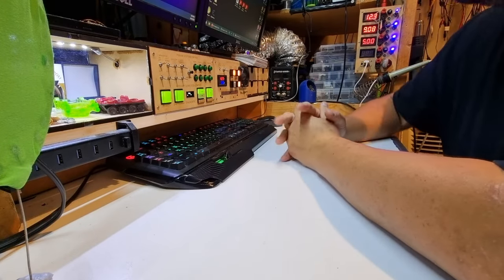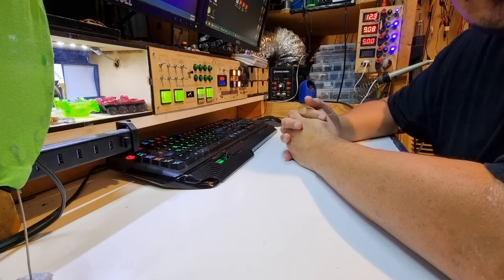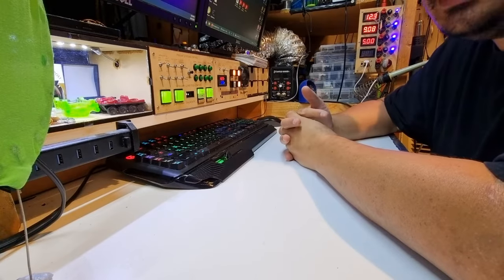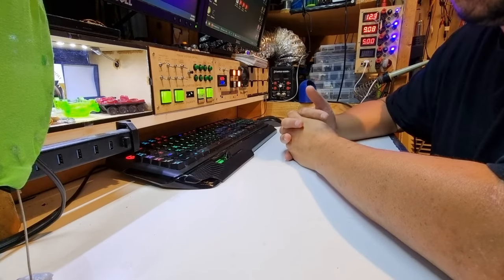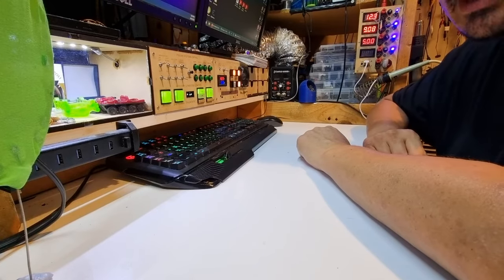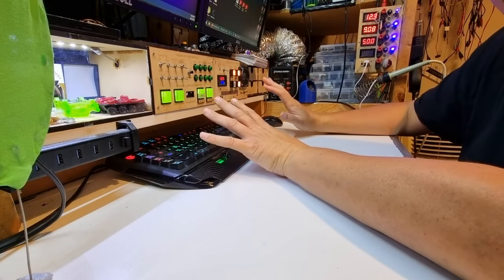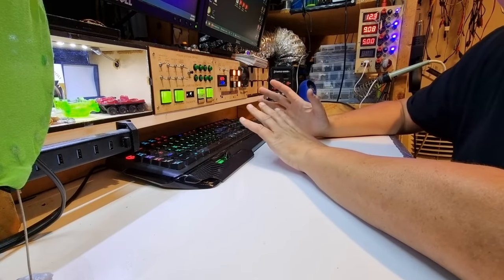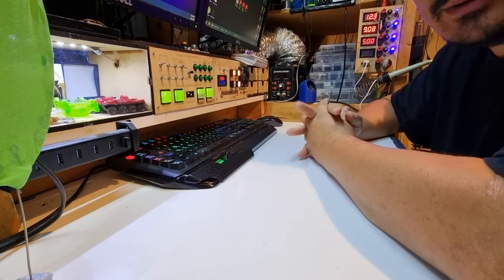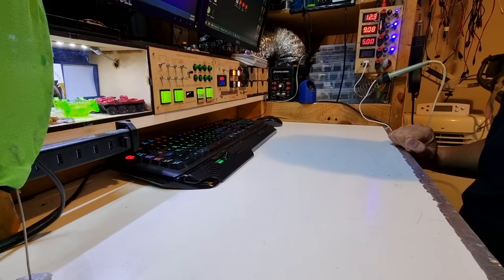Anyway, with this TV, I need to open it up and make a modification to the power switch so that a relay on the Raspberry Pi can trigger the TV to turn on. That being crucial to the one button setup I've got. They can use a wireless remote for some wireless power points, and they can turn on all the light and sound show in one go, and everything fires up automatically rather than having to walk around and turn on TVs and have a dozen remotes. So we're going to put a TV here and get it opened up.